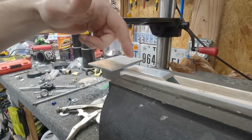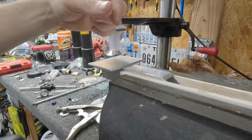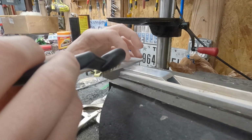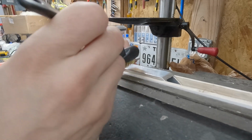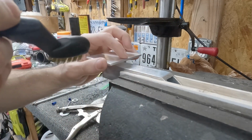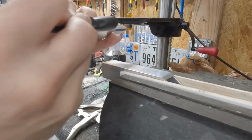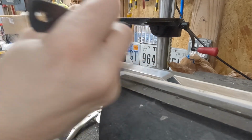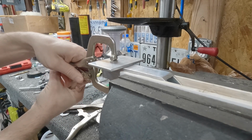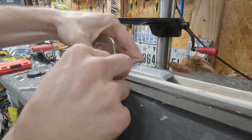And then I'm going to heat the material, and when it's hot enough, that brazing rod should just start to melt, almost like you're welding, but without the arc that generally you use to heat the surface up. So I'm just kind of eyeballing this. Let's roughen those edges up. Use that just to help clamp it in place.